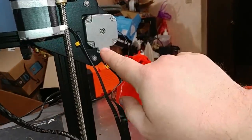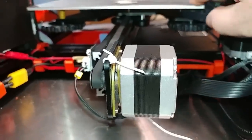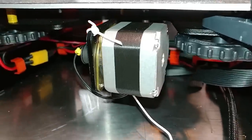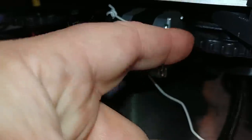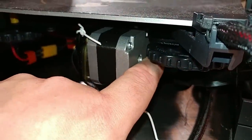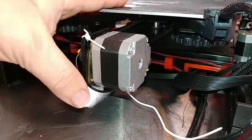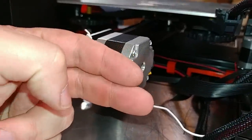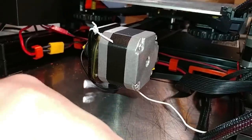This one I can't do that with because the stepper motor comes right up against it — this will hit the heat sink. So the only way that's going to work is if I get rid of most of the teeth on the heat sink in these two rows so that this has clearance to pass. I may just attach the heat sink to the side — better than nothing. This other one shouldn't be a problem; just attach the heat sink to the bottom.